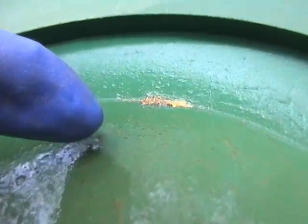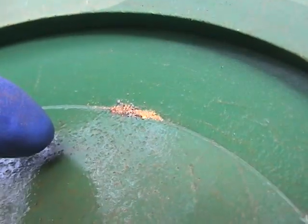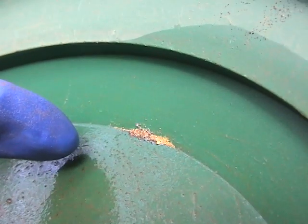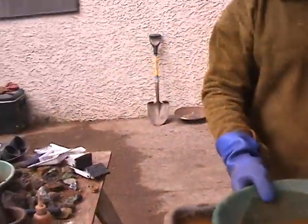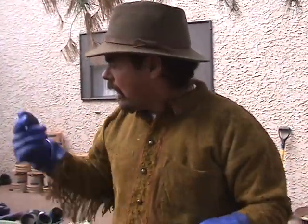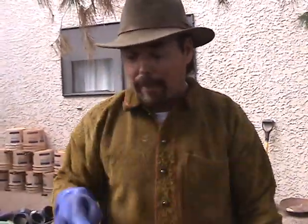Actually it's not even five because some of those still have to be crushed. But you can see some of that beautiful looking gold in there. If that don't make you happy, nothing will. So there you have it — there's gold in that limonite. The problem is that it's really super fine and you've got to be really careful when working with gold that fine. We'll use jet dry or some type of a detergent in the water with the trommel so it doesn't float right on out. Gold will literally float on top of that water if you don't break the surface tension.